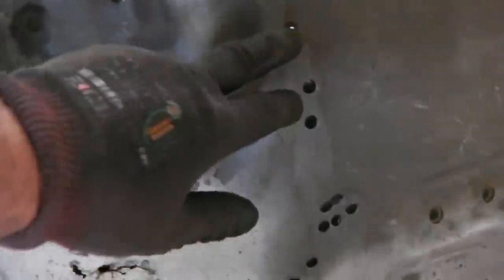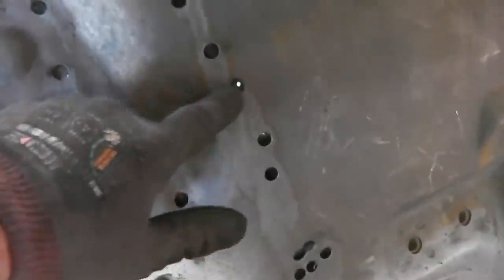Now, they're not going to land exactly right for this reason. When I placed that pilot bit in and I drilled them out, you never really get them in the same area. So what you would get, you'd always be within the circular error probable, which is a technical term for being within a certain radius of a target. So CEP, each one of them, if it hits that, okay, you know your chassis leg's right. What I'd do in this case, as well as measure, is I'd also do an average. So you divide the amount of holes that are in to the left and to the right and up and down, and you get an average figure of whereabouts you would move it. And the more holes you have, the closer you are to accuracy.